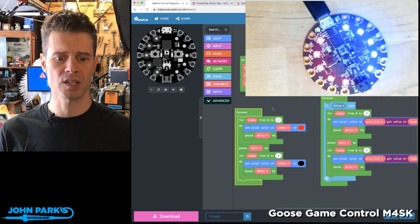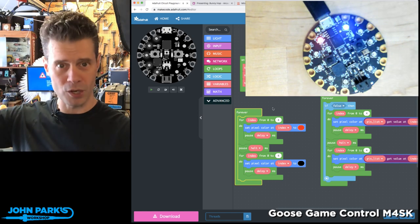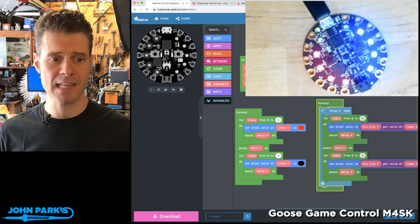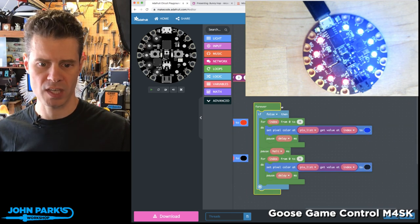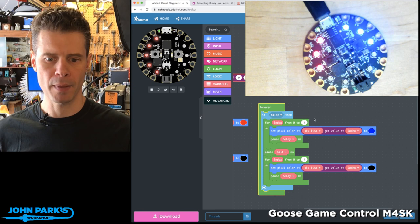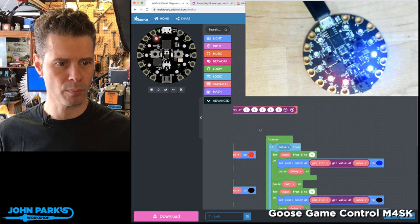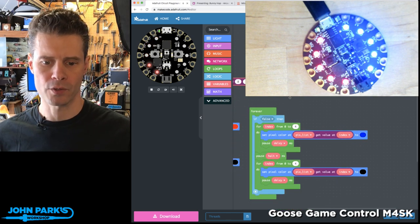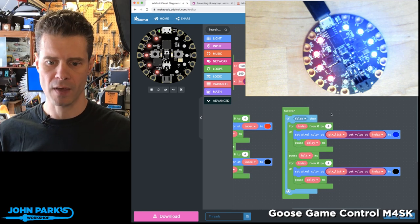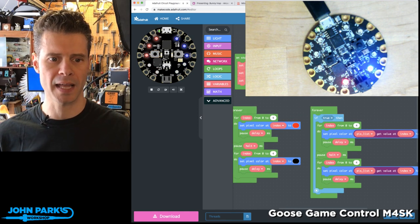And you can see the way I'm running through that is I have an index of numbers that goes 0, 1, 2, 3, 4 to light them up, and then 0, 1, 2, 3, 4 to turn them black. I have a second one that's not running right now, and I've just encased this in an if false then, which is just a handy on-off switch loop. Inside of here, I'm running the other five NeoPixels. So for this, I'm using a little array that I built, of 9, 8, 7, 6, 5. And those first go blue, and then they go black. So if you see in my simulator here right now, I'm only running the red ones. If I flip this to true, I now have essentially two forever loops running at the same time.